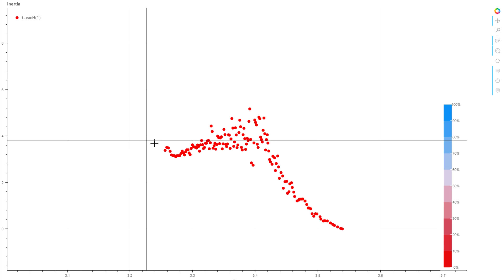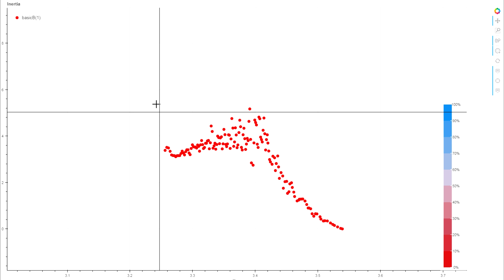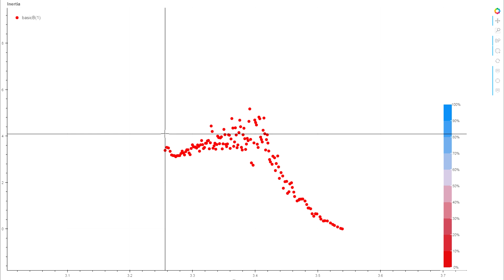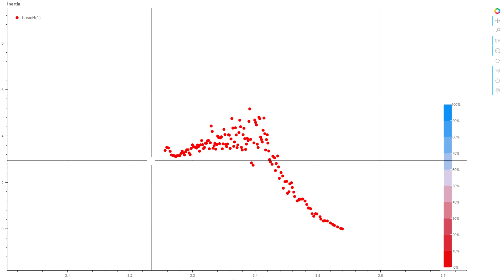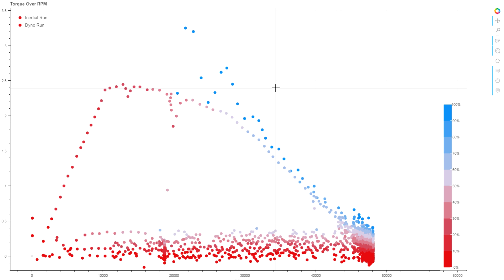The moment of inertia is a static value — it doesn't change over time. So with the same motor and brake disc mounted, the inertia must always be the same. But when we run this test on 3S instead of 4S, we suddenly get a very different value — rather than around 3.2, we're getting something noticeably higher or lower. That points to something else being wrong, and it isn't in the inertia calculation itself — it has to do with what we're reading on the dyno chart.